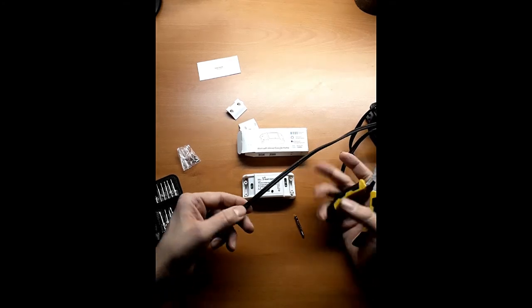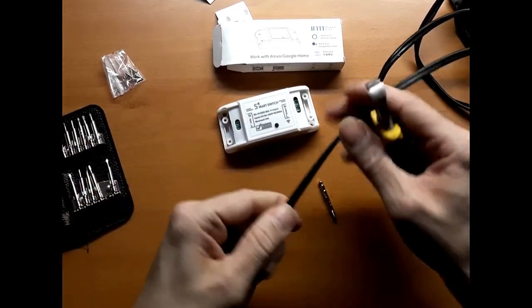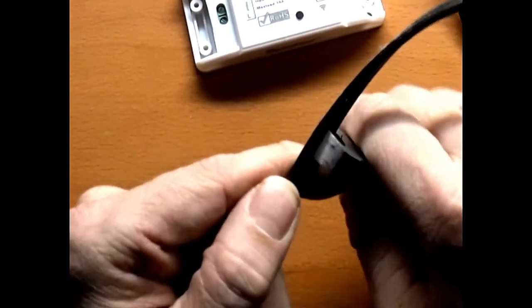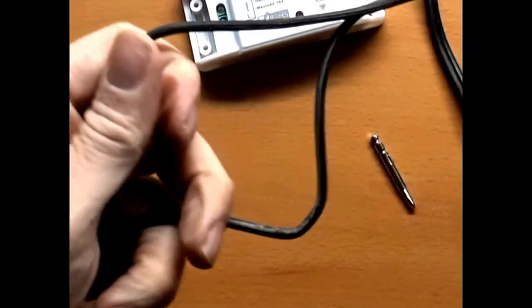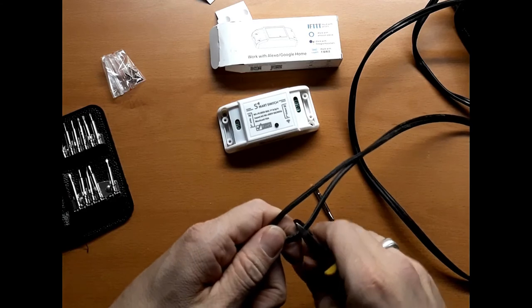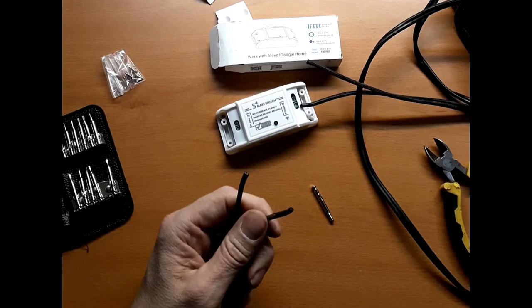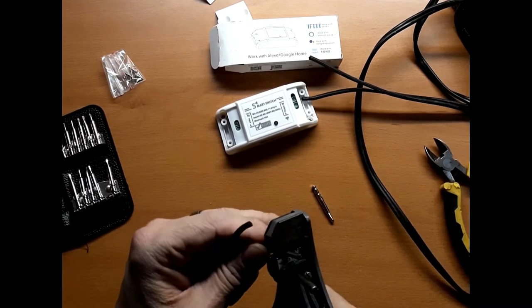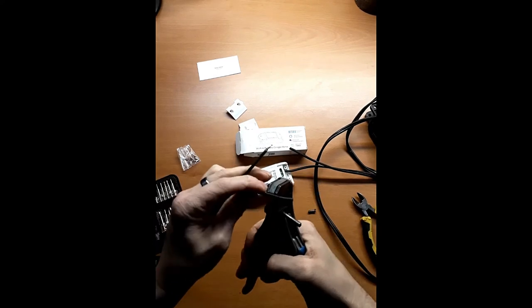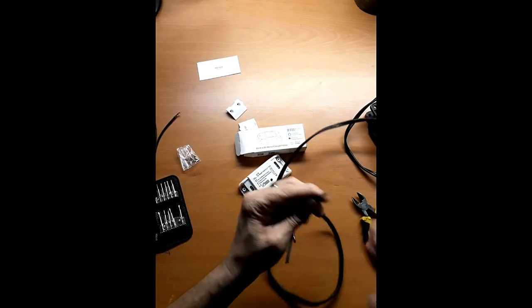So first of all, we're going to take this cord, your regular 110 North America cord, and we're going to split it in the center here a little bit without clipping the wires. Just my own personal preference for doing that. You can do it any number of ways, clip it first and then do it. And you want to strip off a small bit off the end of the wires, bare a little bit of them, not too much, you can see there. And you do that on both connections.